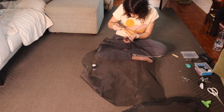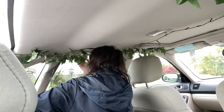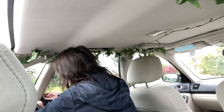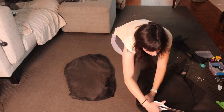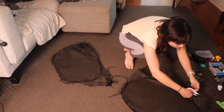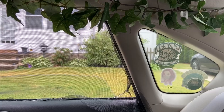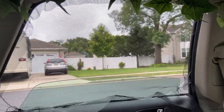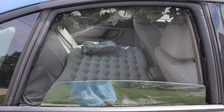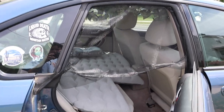I used thin black thread and reinforced every few inches with a little knot of thicker string. Before you cut off the excess screen material, test it out in your window to see if there's any you should leave. I cut off the top excess because it wasn't necessary, but left the bottom and especially the bottom two corners since they fit a little funky. Now the screen should fit right in the window — and I have two screens made with wire from Goodwill for about $2, screen mesh for $7, and supplies I already had.